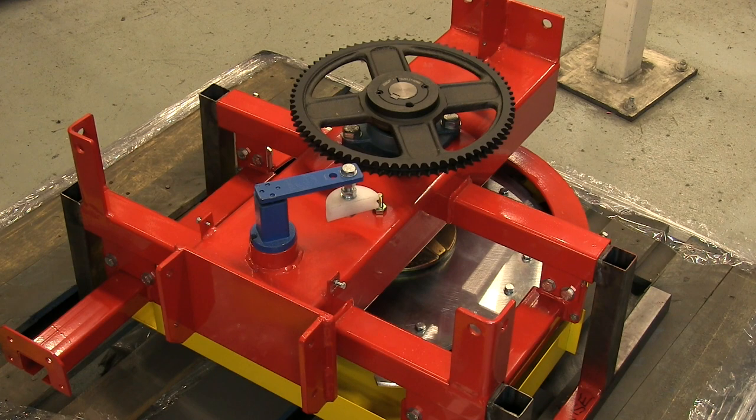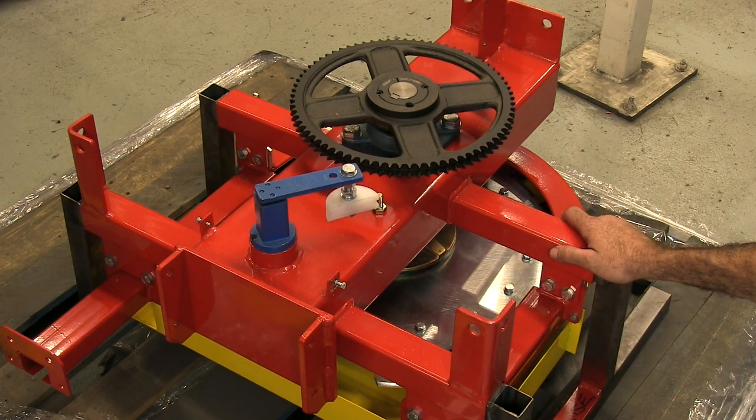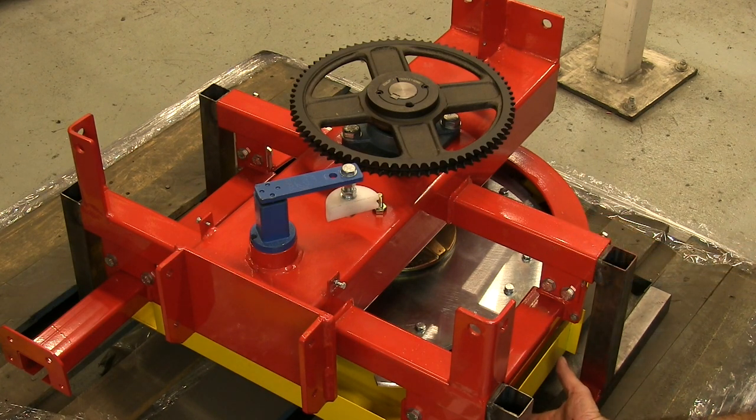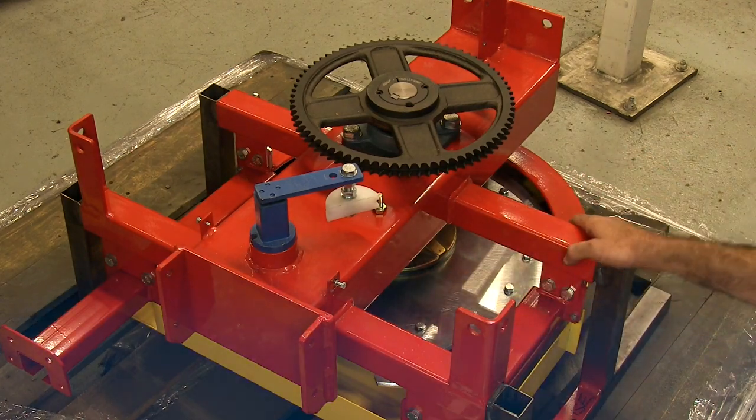Personally, I think this is an easier drive to maintain. It's got the same clutch on it, it's easier to engage the chain, easier to see the chain, and fewer worrying parts. The guard is underneath here — you drop the guard off and there's the same torque limiter on here as there is on the inline drive.